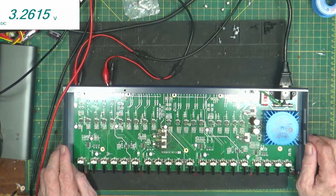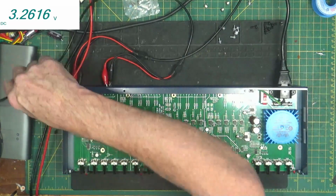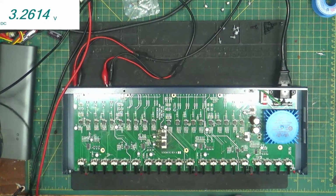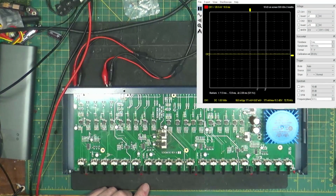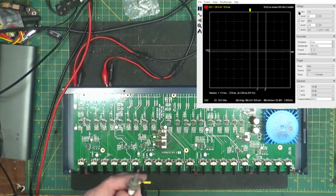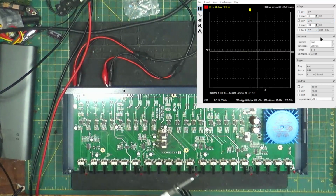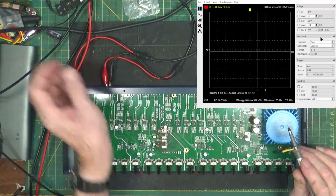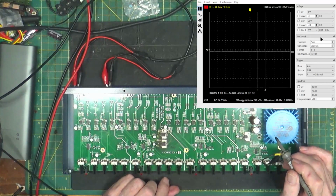Well, I have an idea. I wonder. Let's take a scope here and get channel 2 up. Let's put channel 2 on. Get rid of 1. I got this probe in DC and times 10 because that's sort of what this does. It's just a capacitor in series. So let's turn it back on. And what I want to look at is the inputs to these things.